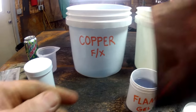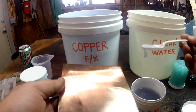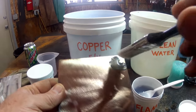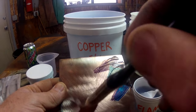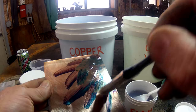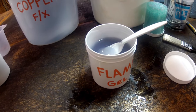There's a million different ways you can put the gel patina onto your steel. I'm just going to take a little plastic spoon and drop it on there. You can see it instantly turns color. But rather than neutralize that and rinse it off, what you might want to do is drag the color into some different effects — let some of those effects be lighter than others. The longer it stays on, the darker it will get. So let's neutralize that. This is a little different than the spray patinas because you have to rub off that gel.